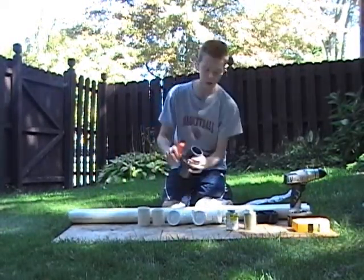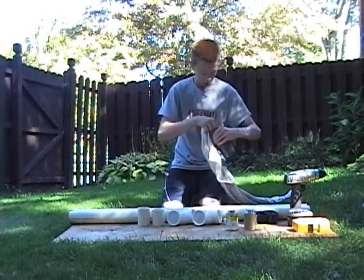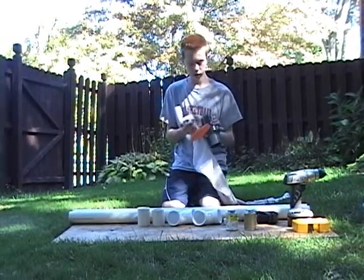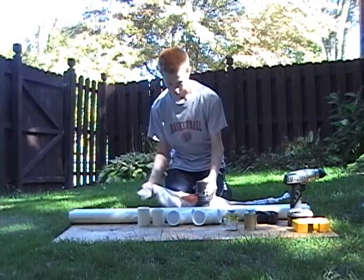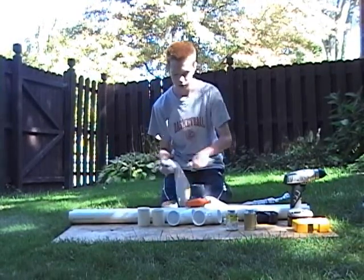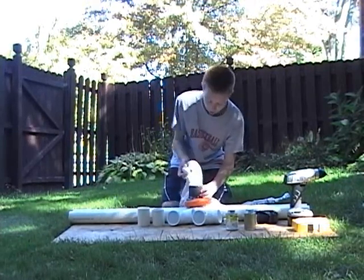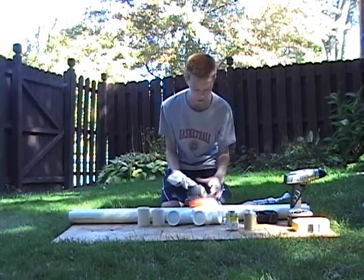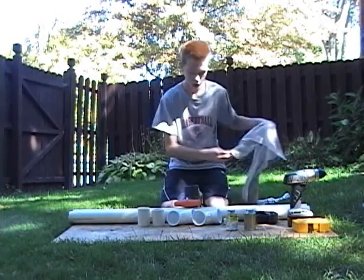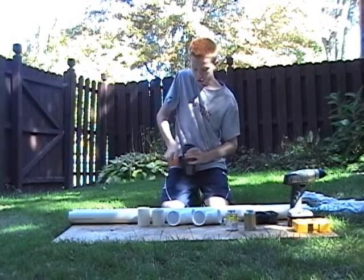Just close the ball valve — if you look in there, it's closed — and then just rub the grease on. Do this to both sides. Then just open it and close it a few times to spread the grease around. It should open pretty easily.